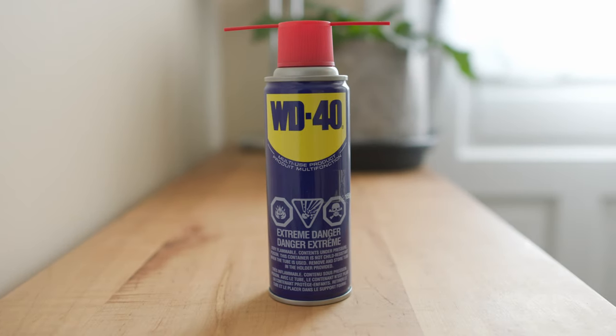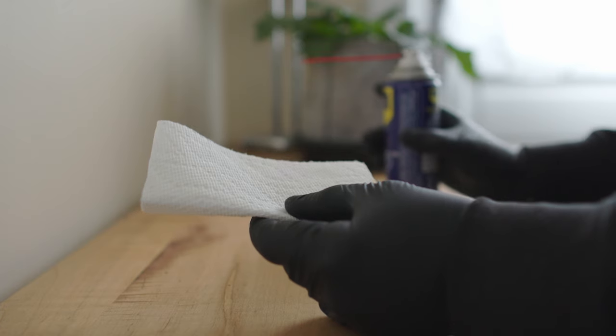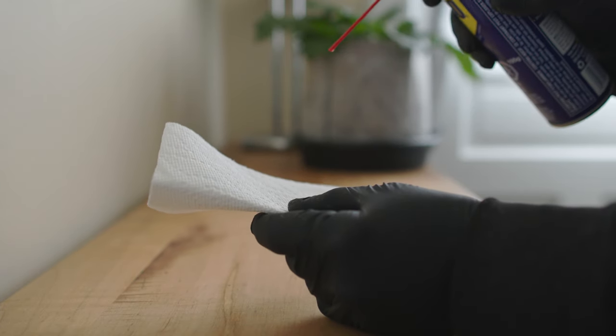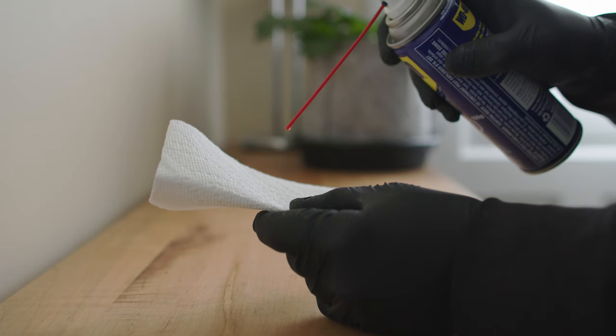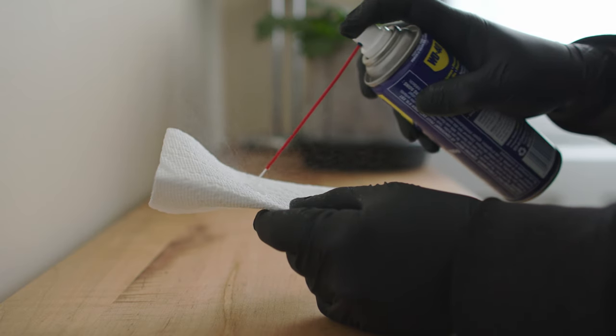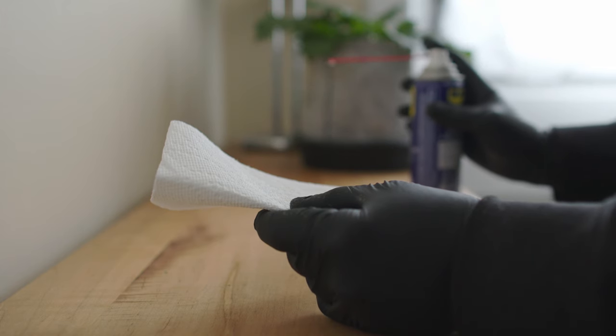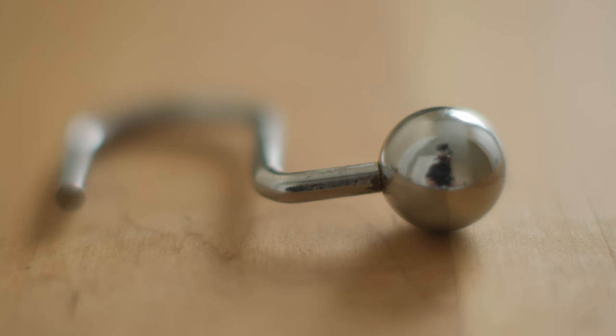Since it's pretty much proven that these are capable of rusting, you want to give them some kind of coating for protection so they don't rust again quickly. There's no foolproof way to keep metal from rusting, but you can slow it down. In this case, I'm just going to spray a little WD-40 on a paper towel and give it a wipe. You can use gun oil or light machine oil, but a lot of people use WD-40 on their tools and it seems to work. I'm not going to make them dripping wet since these go over my shower curtain — just a light buff.